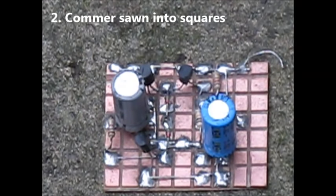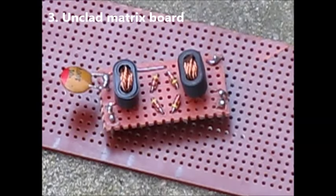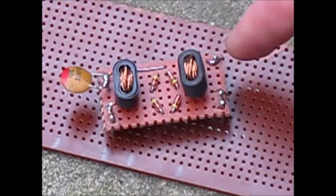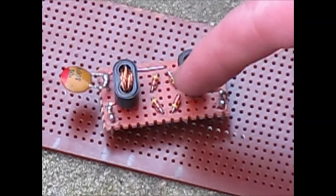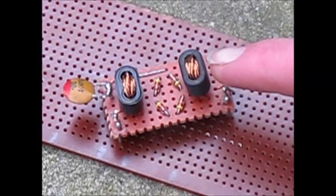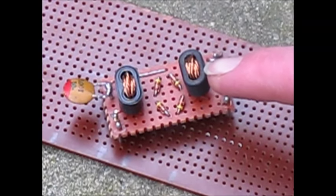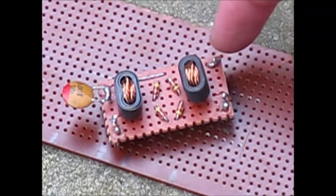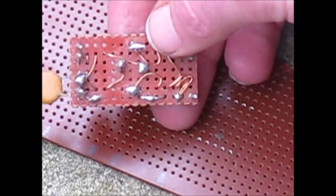Here's one of my favourites. It just uses a single-sided piece of circuit board material, but cut into squares — you can use a hacksaw and mitre box for that. Another option is unclad matrix board. The holes are normally two and a half millimetres apart, so they'll accommodate most of your standard IC and component packages. You just solder the wires together underneath. The main shortcoming is, like with printed circuit boards, you have to turn the board upside down in order to remove components.